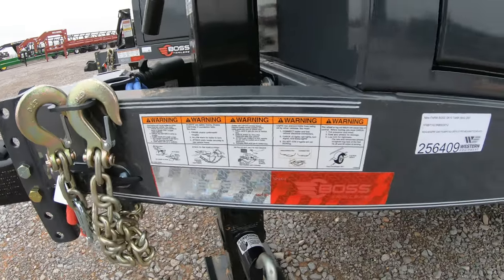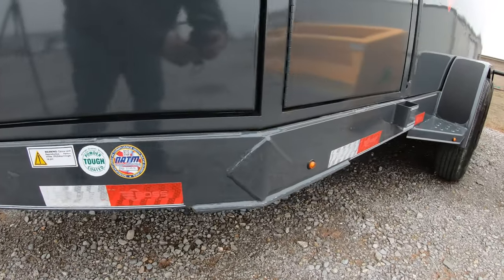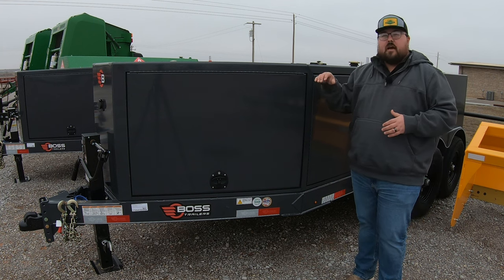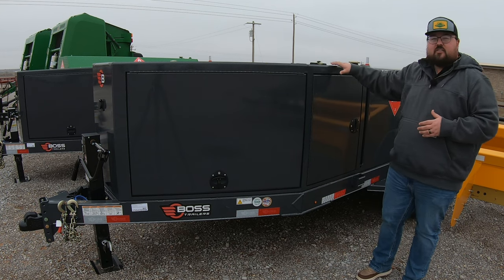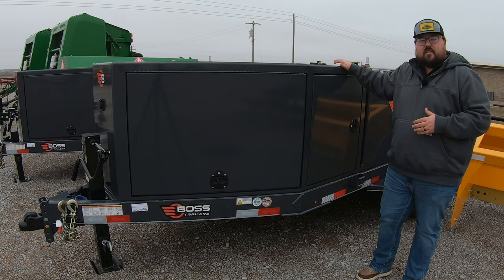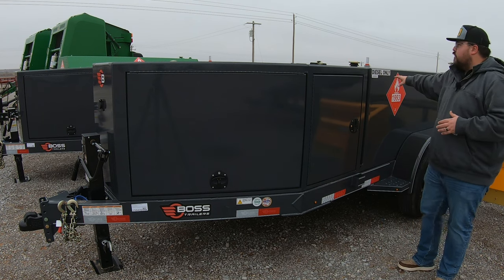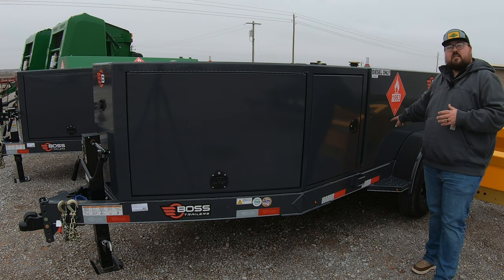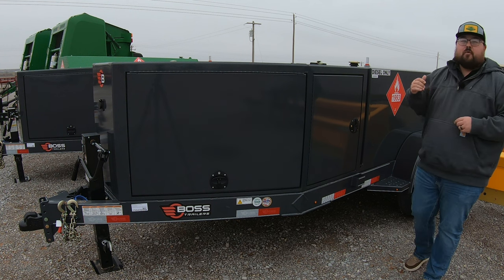Now, as far as the framing goes, what you're going to have is 6-inch C-channel frame running all the way down the length of the trailer. Here at the tongue, normally you are going to have your pump box here at the front, and then sometimes you'll just have an extra 28 inches here that is ready for the DEF system. This model here is going to have that DEF system on it, which we'll show here in a minute. Then once we move back, we are going to have our 990 gallon tank here. That is going to be sitting on top of 2 7,000 pound axles, giving this trailer a GVWR of 14,000